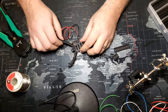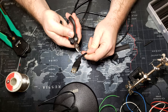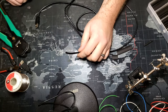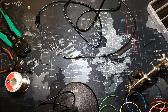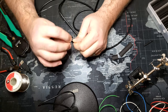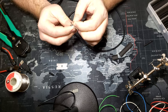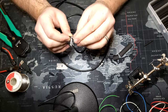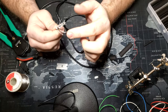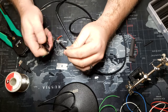Now it's time to move on to our sacrificial USB cable. We've got our head tracker built, so we'll set that aside and take our USB. Make sure you don't clip the wrong end. Next we need to find a creative way to strip the shielding off — I don't recommend the method I used, which was a razor blade. Most USB cables have four wires plus a silver wire bunched up around them. The silver wire is part of the ground. A lot of USB cables will have a white wire, a red wire, a green wire, and that silver wrapping — the silver wire is the ground.